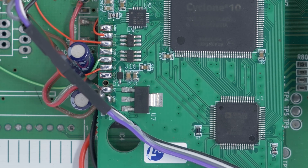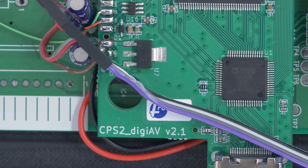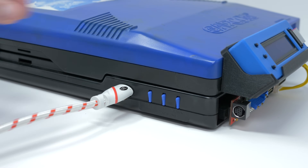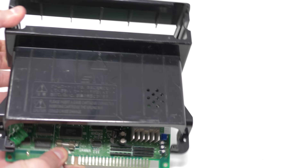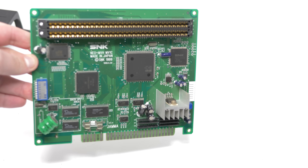The focus of this video is the CPS Digi AV board, formerly known as the CPS HDMI. This board was designed by Marcus, the same person who created the open source scan converter. It was originally designed for Capcom arcade boards, but Marcus created a custom firmware that allows it to work with the Neo Geo. At the moment, it's only compatible with the MV1C motherboard, as that's the only Neo Geo that outputs both video and audio digitally.